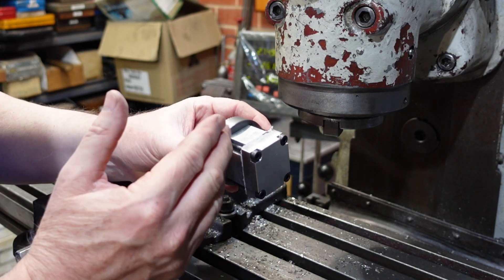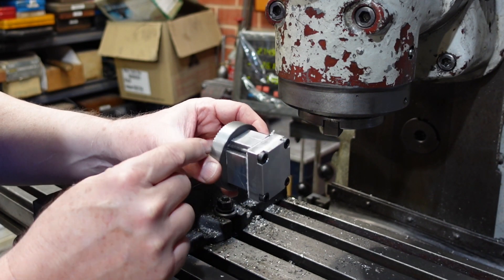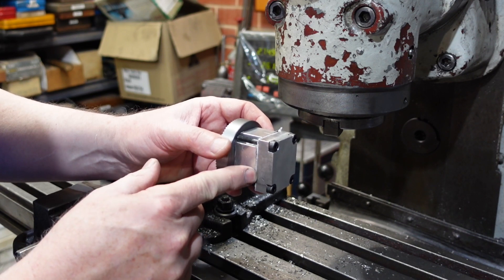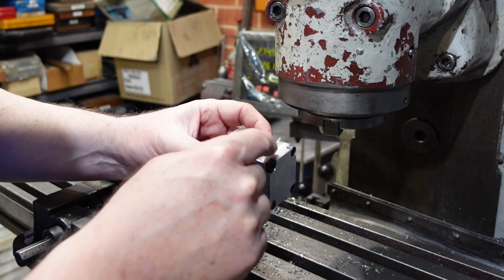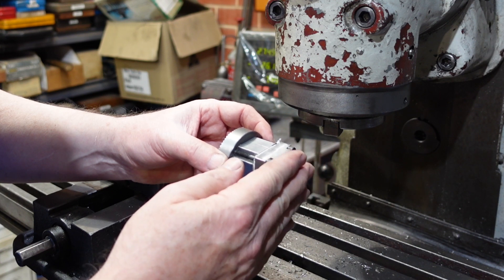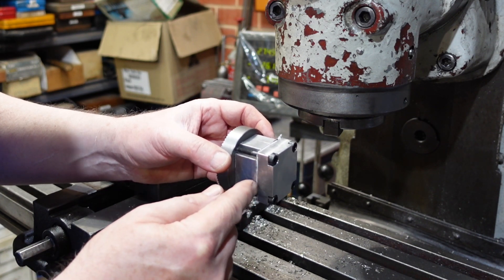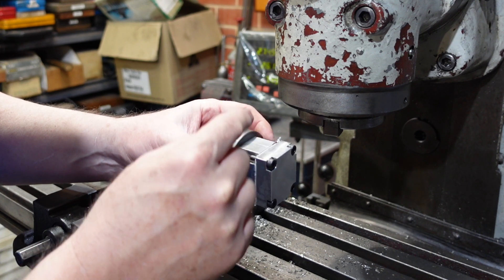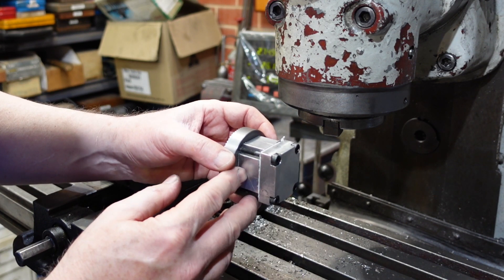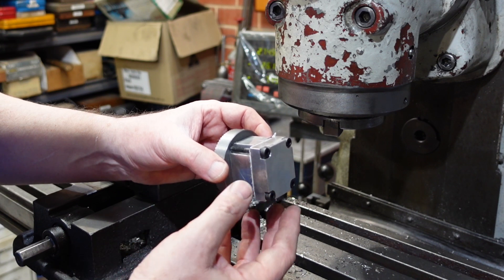Here's one side of my coupling with the clamp for the tube on it. I'm going to bore a 25-millimetre diameter hole there to fit on the tube. There are several ways of doing this - the one I'm choosing is I've got some card here around about one millimetre thick, so once I've bored that hole through there I'll have a one-millimetre gap from a perfect circle. Another option is not doing that and just having it clamped up, but then you'd have to face off a little material from the joint. A third option is to have it as one piece, bore your hole, then slice through with a saw to give you the gap. You do need that gap so you can clamp up on the tube without crushing it.